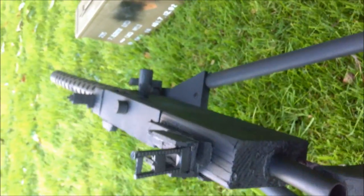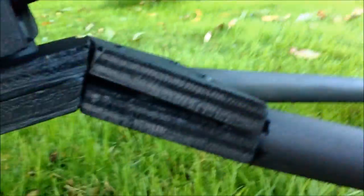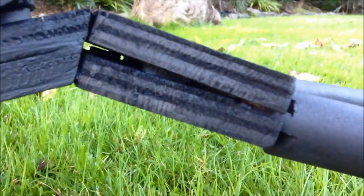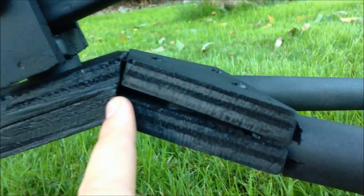It does move pretty smoothly on the tripod. Now moving on to the tripod — like I said, that's a broom handle that I cut. The plywood pieces are screwed together and PVA glued. I used a mop handle, kind of cut a bit off, and then cut it out from the plywood and glued and drilled that together.